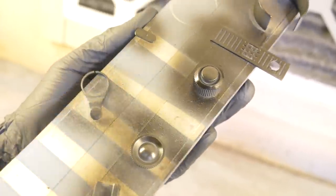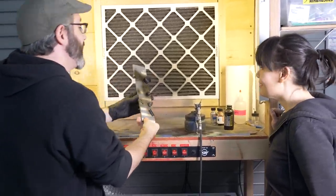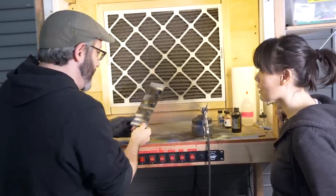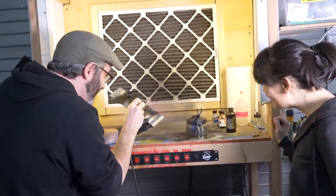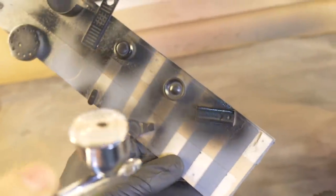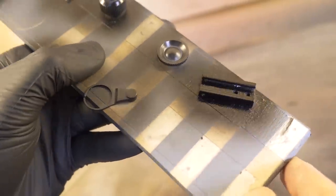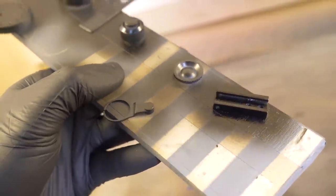The first coat is dry to the touch, so now we're gonna do the wet coat. And you gotta be brave with this, because you have to cover the whole surface you're doing in one pass. Otherwise, you'll get the fall off, the dust on it. So we're gonna be brave. All right, you first. I will show you what we're doing here. I have a good wet layer covering the entire surface, and we have that really decent, even, glossy sheen. That's what we're going for. Just enough to get that without so much paint that it starts to drip off the part.